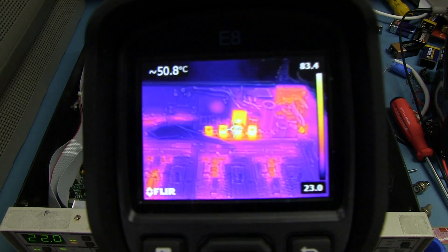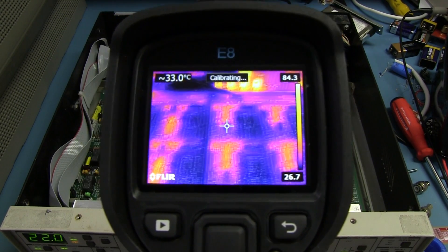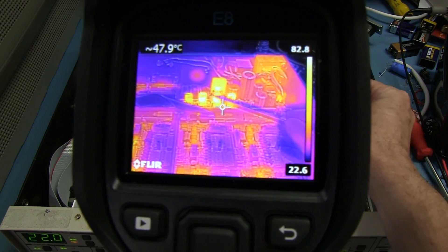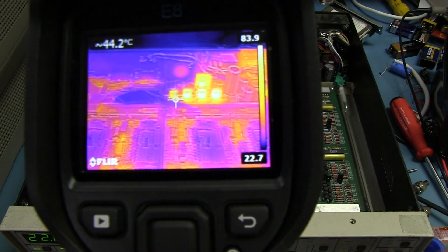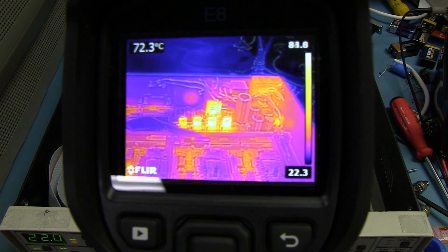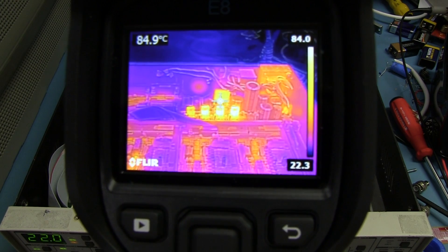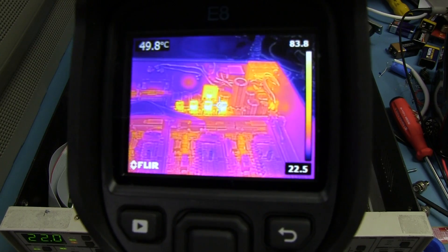Using the thermal imaging camera we can see parts of the product lit up — individual chips and relays, the relay coils, five heat sink devices up here, and the transformer in the corner. But these aren't true temperature measurements. You can see a device in the top left corner showing around 70, 80, 85 degrees — but that's not what it will be with the lid on. It'll actually be lower than that.